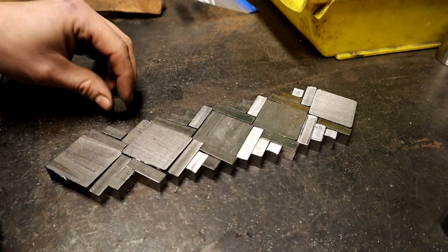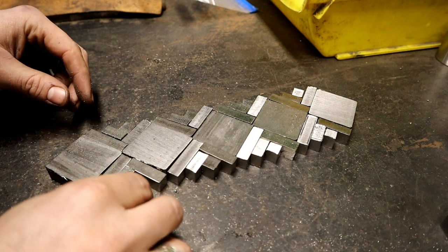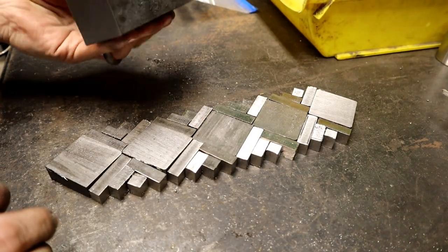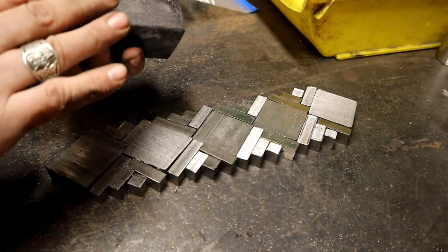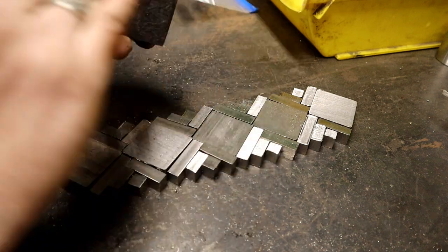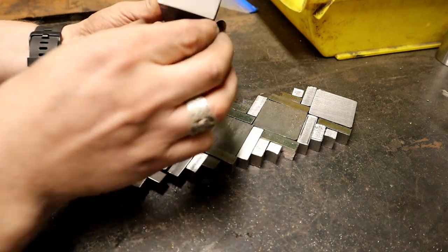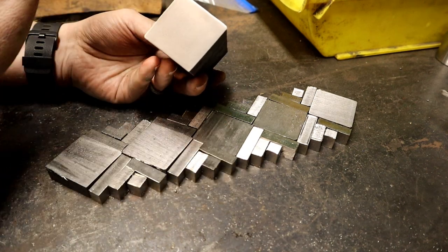Now Mosaic Damascus is a lot different than other Damascus. See, your pattern is always on the face of the billet. So for instance, here's my main billet. Normally when you make a billet like this, you draw your blade out here. Your pattern is created by all the different layers and whatnot stacked naturally this way. But here, your pattern is actually on the face of your billet.